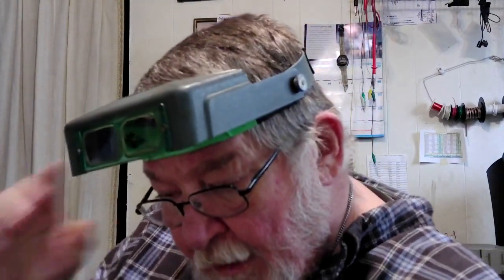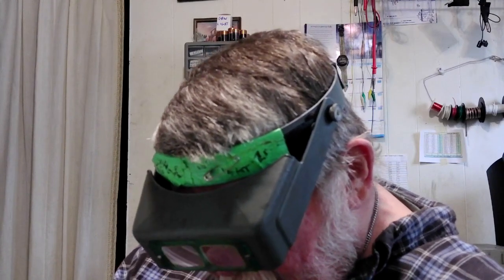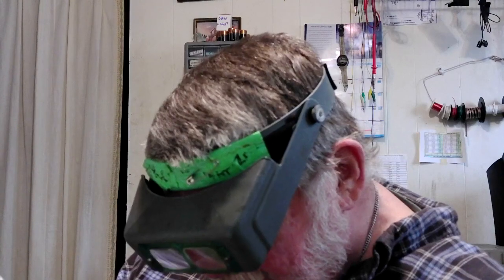Okay. Now down here at the bottom it says, type 12BA6 is identical with the type 6BA6 except for heater ratings. And we saw that in our first tube. They work the same. It's just that this tube uses a little higher voltage, a little higher heat than the 6 does. That's all.